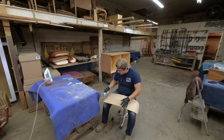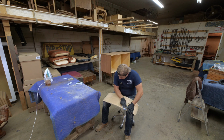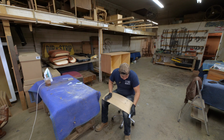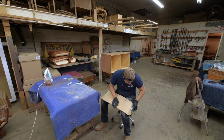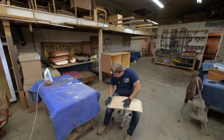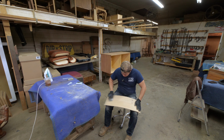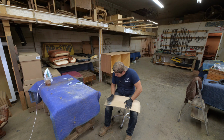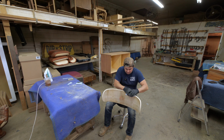Okay, so now I got the first sanding all done. Come back with the 220, just same thing, just work it with the grain. Using this 220, you're going to start seeing the clarity of this grain popping out. It's now taken us, and all the swirls are removed. It's now just getting off those 150 grit marks, which are very fine, to sand off anyways. It's not hard. I'm going to go around the outside because this was also hit with the 150.